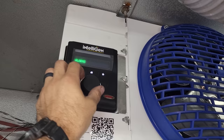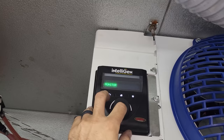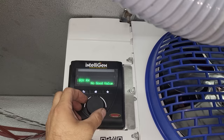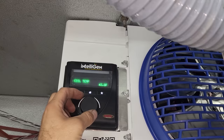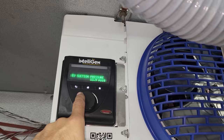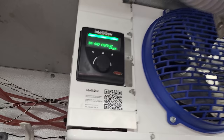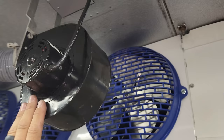We're waiting for this guy — it's in its delay right now. If you go to monitor — box temp is 46, setpoint is 35, cooler one operating mode. It isn't on yet, but it'll turn on in just a minute once the delay time is done. There's really nothing crazy — everything is pretty darn easy. Superheat is set at 10 degrees, already checked that. You can see it's still pumped down at 13 PSI. EXV is at open zero steps. These things are rather easy to work on. I think it was important that I added a suction line P-trap — the old system didn't have that. Those help with oil return, especially for long line set runs.